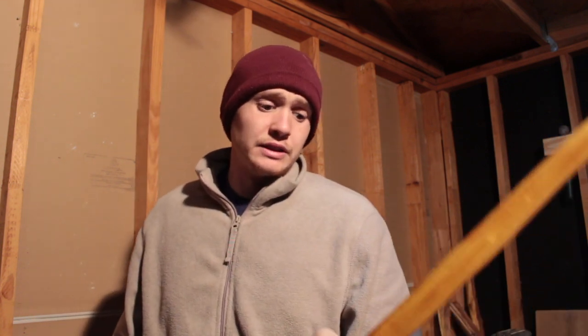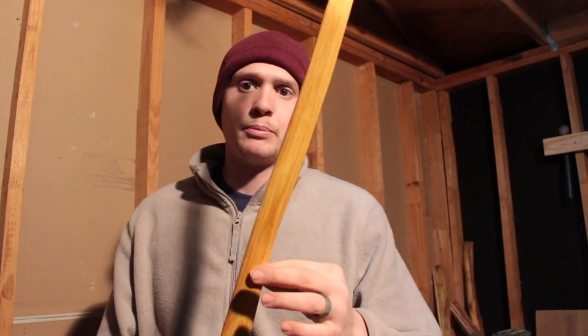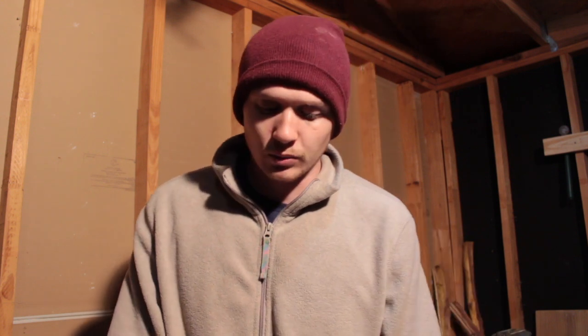I've had the wood out in freezing temperatures with this finish on it, and I've had it out in hot temperatures. I've had it in all weather, and it does great. I've had it in the rain and in the snow. So you're set with this finish. You can also do a spray on poly if you want that sheen, that shine. This will become dull once the linseed oil soaks into the wood and the wax dries. Do what you like. I kind of like this one.